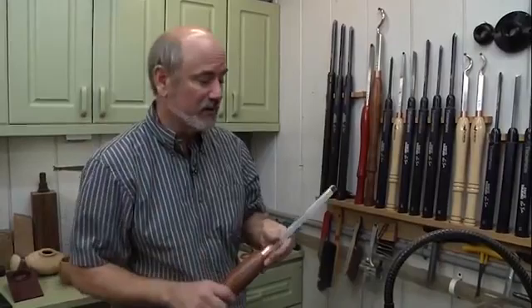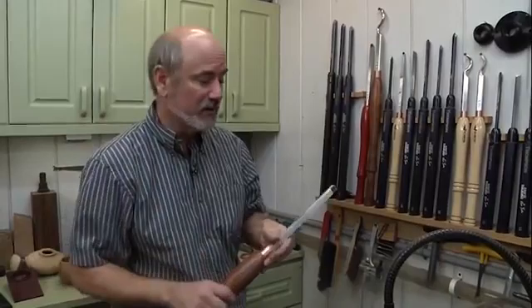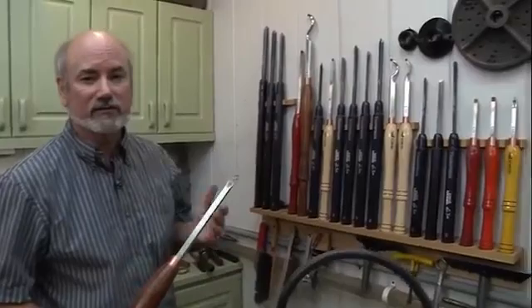One thing I forgot to mention about sharpening — if you go carbide, you'll never have to sharpen again in your life. You simply rotate the tip four times and then replace it. I've had this tip on here for at least a year. If you really don't want to sharpen, or if you have trouble with your hands, going carbide is an excellent way to go. I have a variety of each, and to me they each work beautifully in different areas — sometimes carbide saves me, and sometimes I need regular tool steel for a slightly different result.